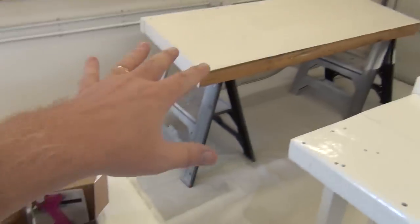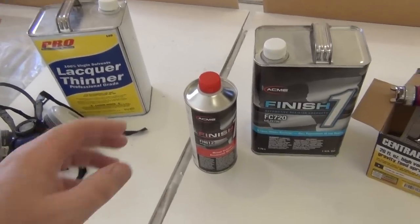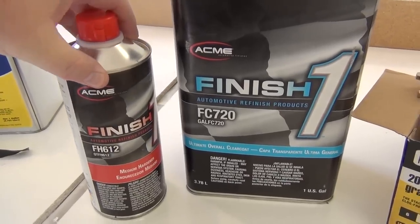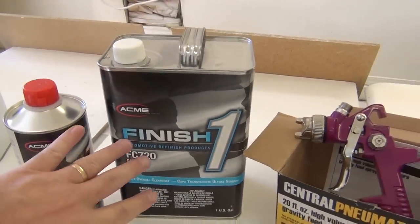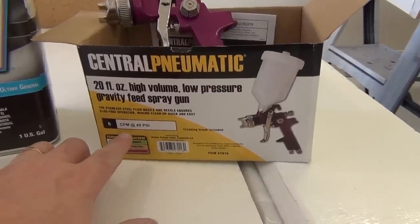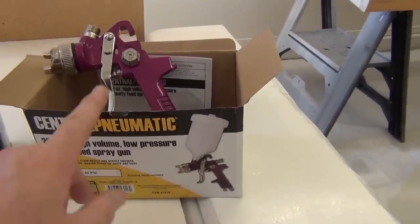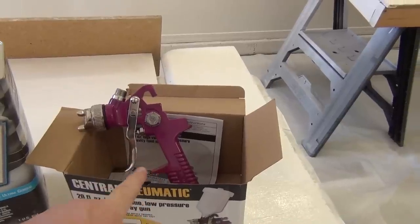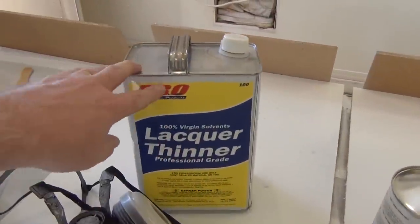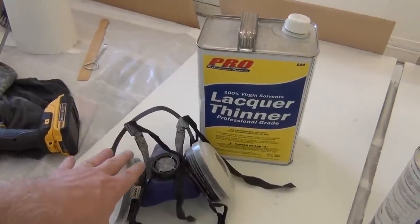This is what I used for all the clear coating. I did all my shelves with a clear coat too so they'll be easier to keep clean — I put greasy parts and tools on them and this will keep them looking cleaner. What I used is Acme Finish One product FC720 and FH612. It's a four-to-one mixture — FC720 is the clear coat and FH612 is the hardener. I used a cheap Harbor Freight gun, about $15. It says 40 PSI on the gun, but I found that setting my compressor to about 70 PSI made a much better spray pattern. You have to get the gun adjusted correctly so you need something to test on, but the manual does tell you how. You got to clean this up really good when you're done — totally strip it down and clean it up with lacquer thinner, which cleans things really well. Make sure you wear good respiration when you use one of these, indoors or out — you don't want to breathe any of that clear coat in.